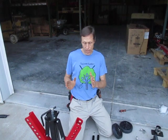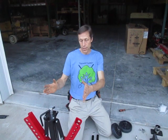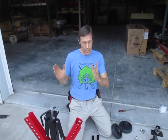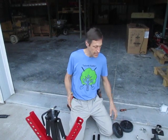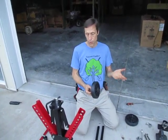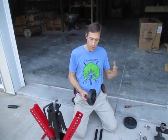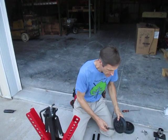The standard plastic gauge wheels that come with the machine are just what's included. You can also upgrade to disc type gauge wheels, which are better for tracking. The disc gauge wheels are a thin steel disc that penetrates the ground a little bit as you move forward — kind of like a train on a train track, so it won't swing side to side as easily. A lot of people find the plastic gauge wheels are good enough, but the disc upgrade is shown on our website as an option.